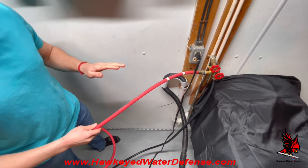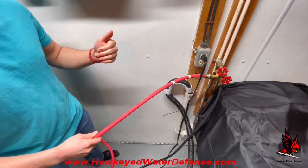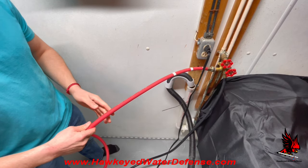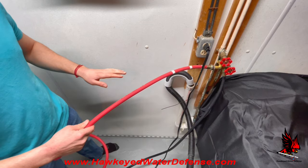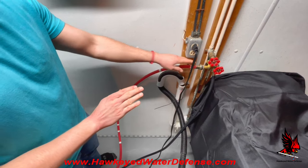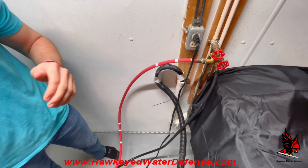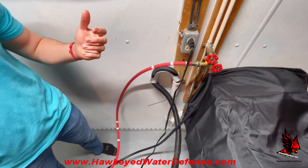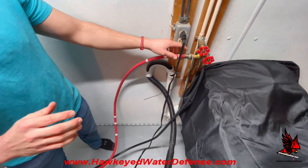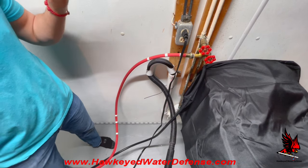Another factor, not overly common but still something to consider, is if the hose is exposed to areas where there could be rodents, as they might chew away at the hose, causing thin walls or a source point for water to leak. Also, washing machines and dryers are typically in confined spaces that build a lot of heat and humidity, which can contribute to leakage.